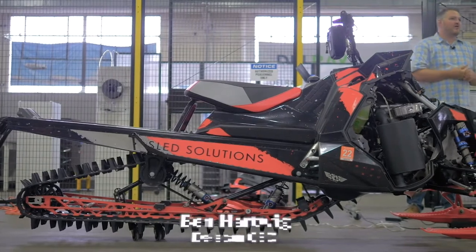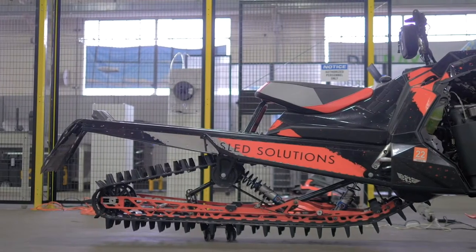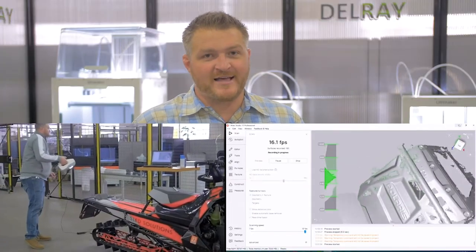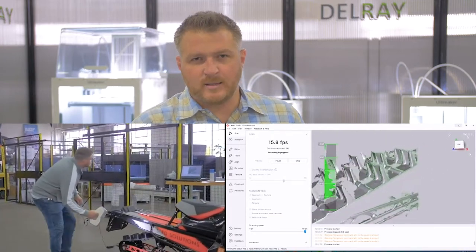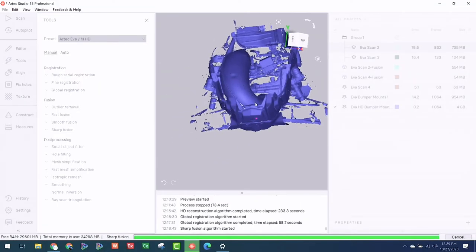So when Paul arrived with the snowmobile, there were some critical areas in the bumpers, or where the bumpers are going to mount on the front fender and on the rear fender. Because his designer couldn't make it to the office today, we used our Artec EVA, which is a great structured light scanner, very easy to use. It's 16 frames per second, so it's very fast — almost like you're using spray paint while you're capturing data. We used the Artec EVA first so that the data would go directly into a laptop via USB connection, and then we could see that data instantly, do some alignments, get some screenshots and images of what the data looks like to his designer, who's out of state and couldn't make it today.